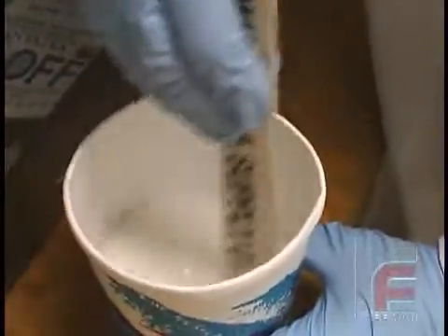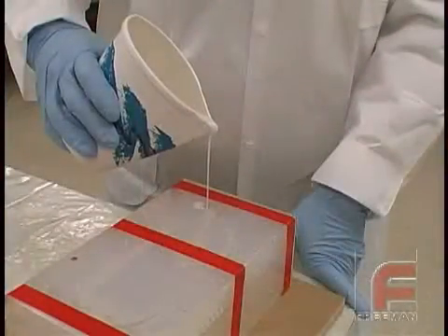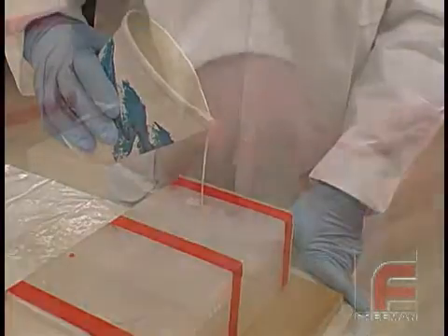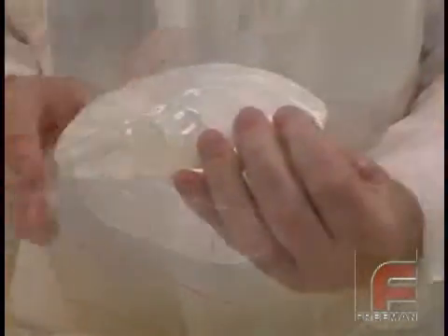The REN Cast Polyurethane Elastomer line is a much slower setting line of urethanes, allowing time for hand mixing, vacuum degassing, and pouring into larger molds. These materials range in hardness from very flexible to very rigid and are used in the widest variety of applications.